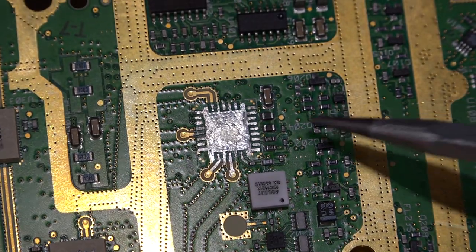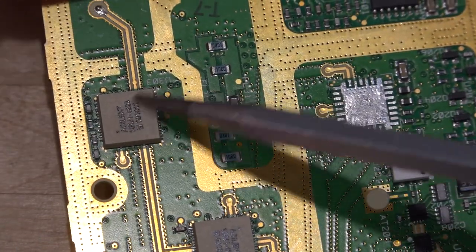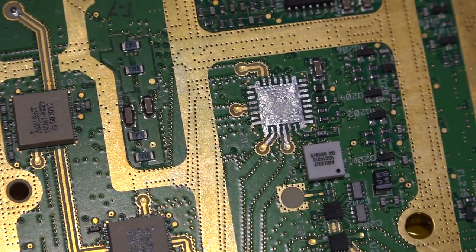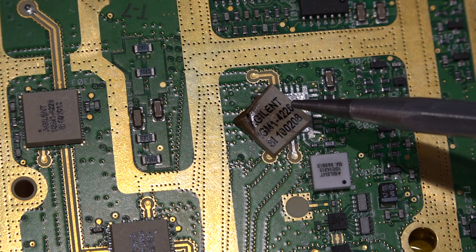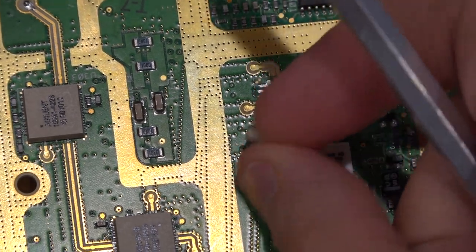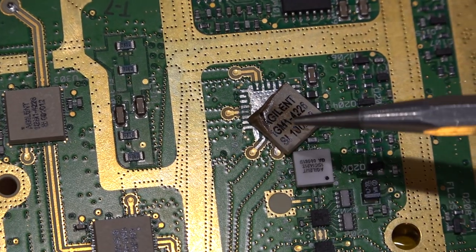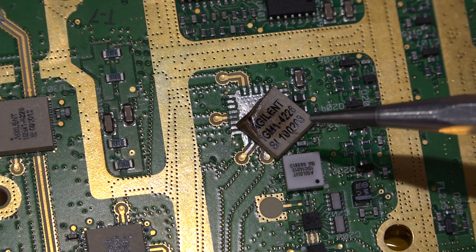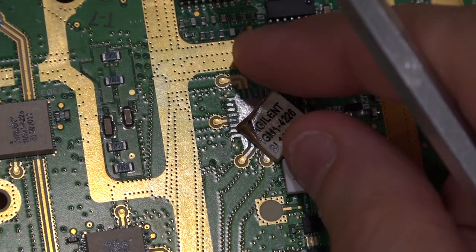The reason they cannot take the heat out from the top is because of the way this is built. This may look like a ceramic top, but it's actually not, and this is what happened to the other one — when I was trying to remove it, you can see it got burnt very quickly from the hot air gun. There's a cavity on the other side of course. These are quite interesting modules — they are multi-chip micro-assemblies, and there's a lot of stuff happening inside. We'll take a look at that separately once we get there.